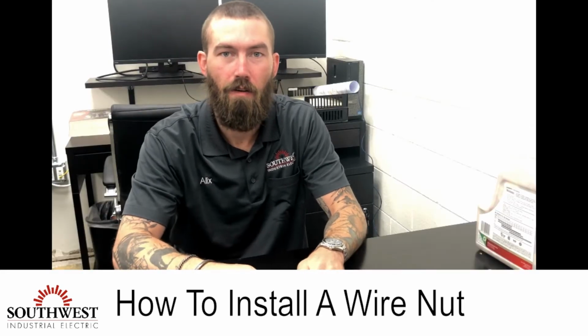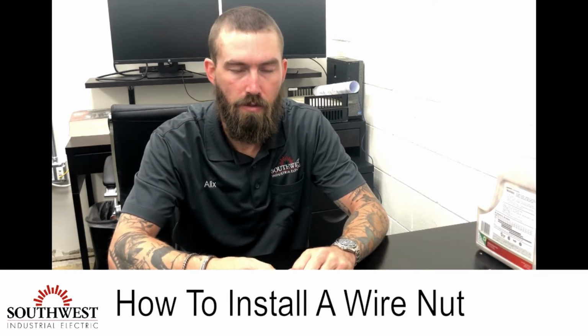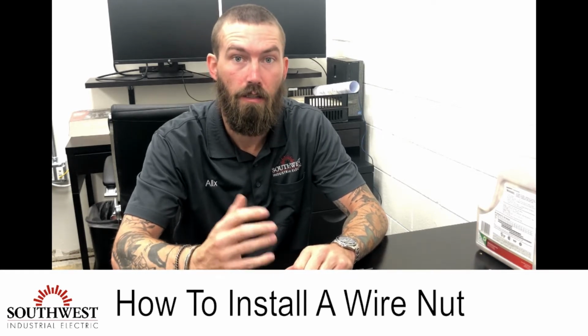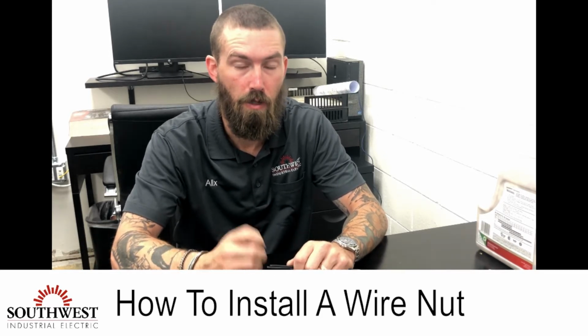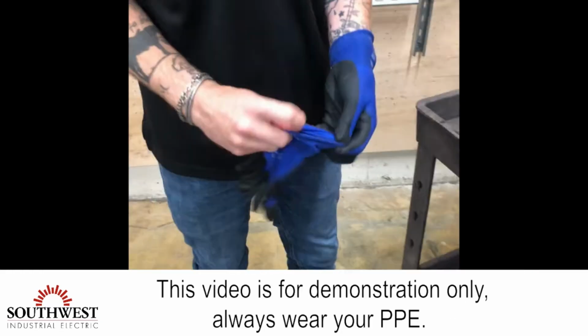So today we're going to go over how to properly install a wire nut. Some key points to installing wire nuts is that each wire nut has its own rating. You can only install a certain amount of wires of a certain size to each wire nut. So before you start, make sure the wire nut you're putting on is rated for the wire you're trying to connect together.